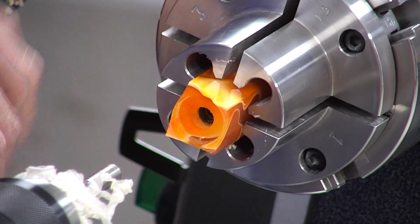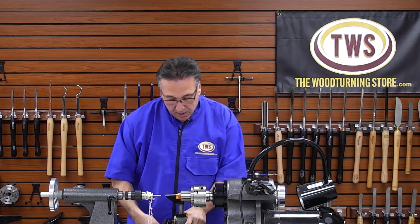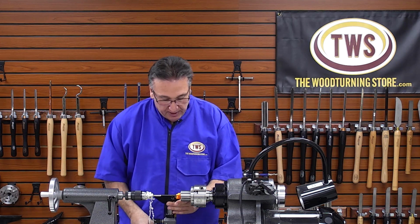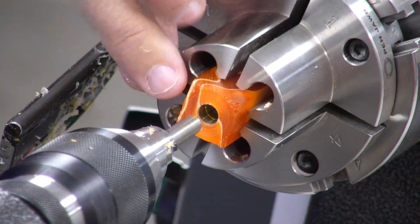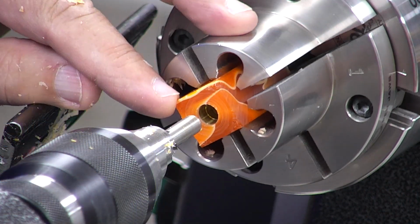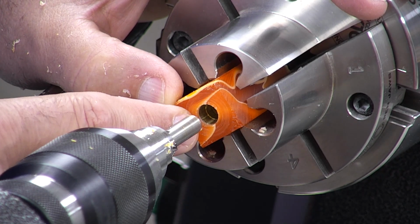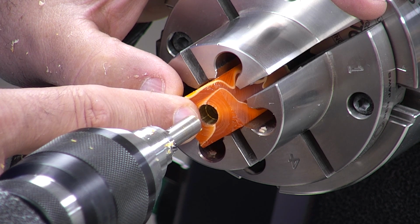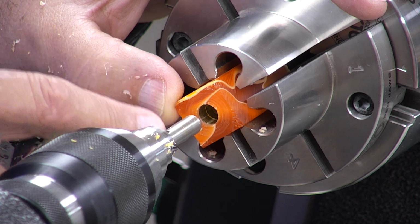What I'm going to do now is, this pen blank was extremely long. I'm just going to take a tool, turn down the pen blank a little bit so we can get in nice and close and show you how we finish. So I took a minute off camera and I just trimmed the blank down a little bit more with a gouge. And now if you look in here, I hope you can see it. I have maybe a 1/16 of an inch of the acrylic blank before I hit the brass tube. So this will show a little more realistic approach of what you would do.